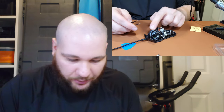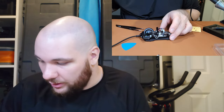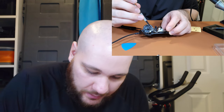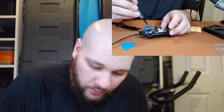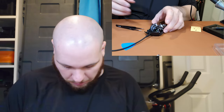The wheel was just spinning before. This little thing is a spring here that connects between a little piece of plastic. I know you can't see. I know this doesn't matter, but I'm explaining it because this actual spring goes here, and this is a spring between that and then this metal rod. This metal rod goes in the wheel, your scroll wheel, and then clips into two places here. And I don't know if you can hear that, but it actually makes the scroll have a noise and holds it in place.